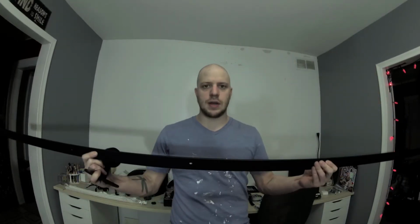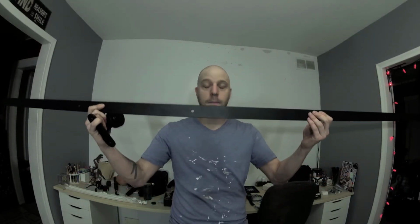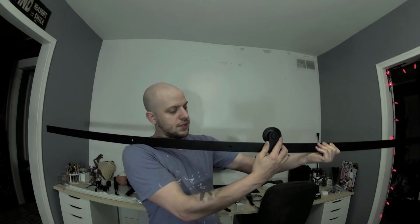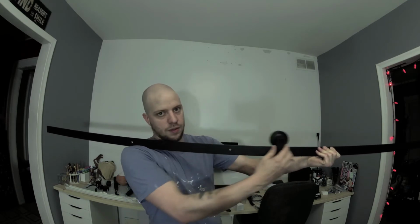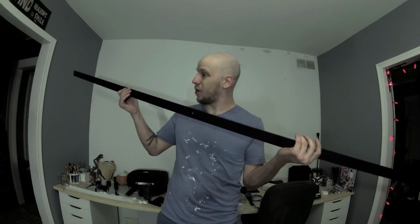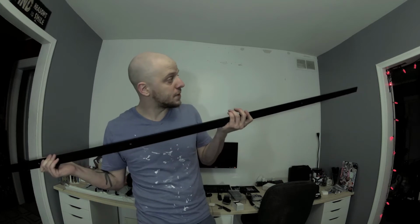So normally this rail will get mounted onto a barn door wall, and then this wheel sits here and rolls back and forth. So then this rail is also going to get cut into pieces. One will go into the piece of wood on this wall, and then the other one will go into the other piece of wood on that wall. So once the 2x4s are up on each wall, and then the barn door rail is attached to that 2x4, the next mechanism that needs to get put together is the pipes.